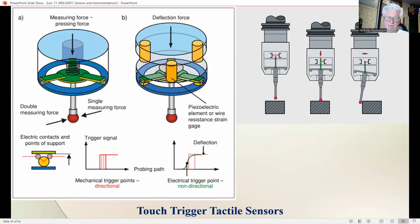Many 3D coordinate measuring instruments are based on a touch probe, with which the contours of an object are followed to obtain 3D shape information with high accuracy, also referred to as dimensional metrology. The touch probe consists of a ball-shaped touching point with well-known dimensions, which is connected to the end of a stylus. The probe is moved by a set of actuators until it touches the object. Next, the movement is controlled in such a way that the point follows the surface of the object, thereby just keeping contact between probe and surface.